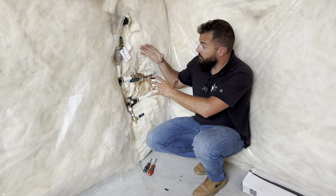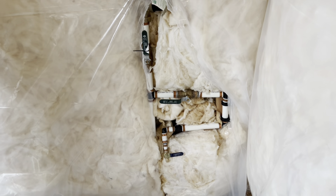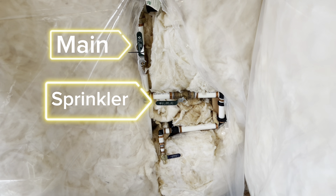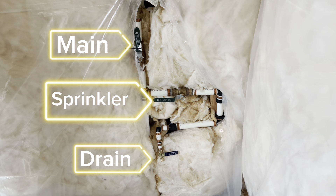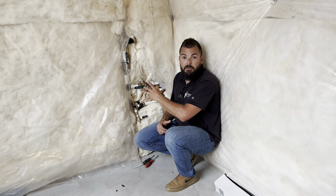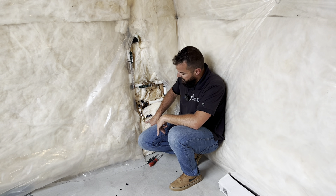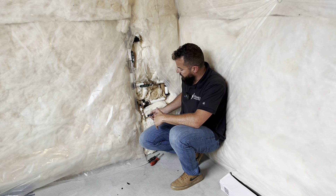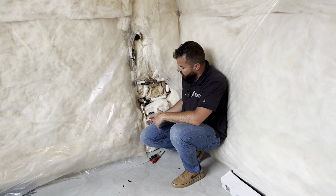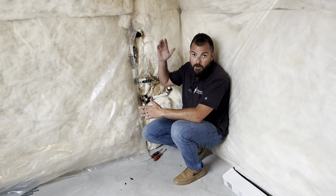On my particular basement here, we have three valves. The first valve is going to be the main water to my entire house. This one is going to be the sprinkler system. And the small valve here is going to be a drain to the sprinkler system for winter. The bottom valve, usually right by the end of the line, is just a drain. You're not going to do a whole lot with this other than in the fall when you get the system winterized — you're just going to drain out a little bit of water into a bucket to get any remaining water out of the system.